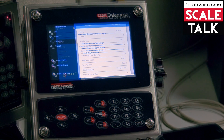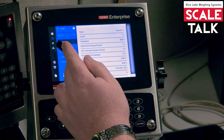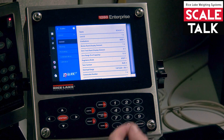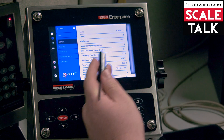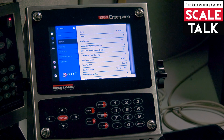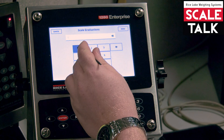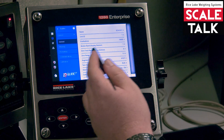We're going to hit back. By default, the scale is going to be 120,000 pounds by 20-pound increments. On the general tab under scales, you can see our graduations are 6,000 — and 6,000 by 20 is 120,000. If we wanted to change that to 200,000 count by 20, we'd first change our grads to 10,000, since 10,000 by 20 would be 200,000.